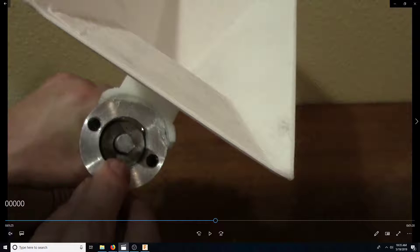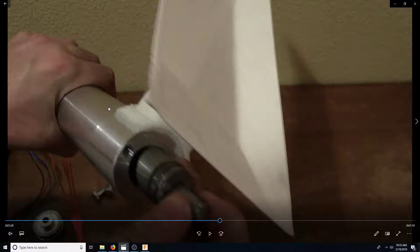Down here this is the rest of the barrel — the barrel is 10 inches long. Here we have a thrust bearing, just like the Multi-Stirer, and the thrust bearing is super tight to this hole with a little bit of air that comes out. Because this is tilted at 45 degrees, gravity will help with the pellets as well as let air out through the top so we don't push air into the filament. A lot of extruders are sideways and the air has nowhere to go — it presses into the filament creating a jacket of high-pressure air around the nozzle.